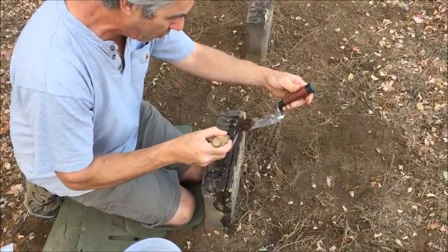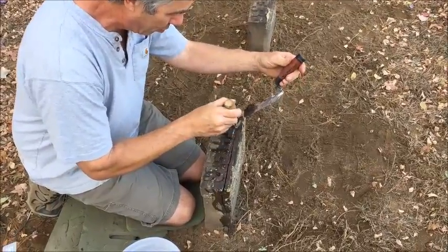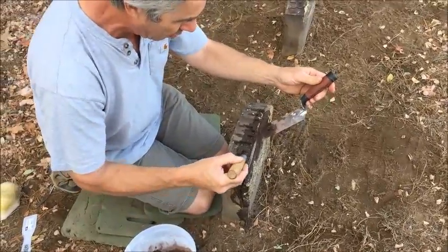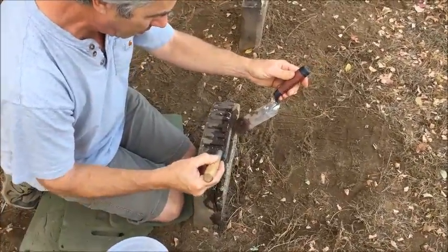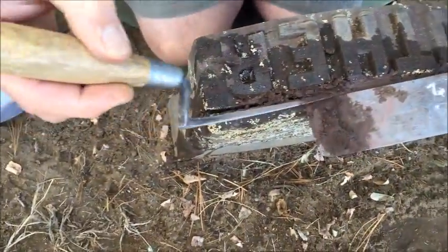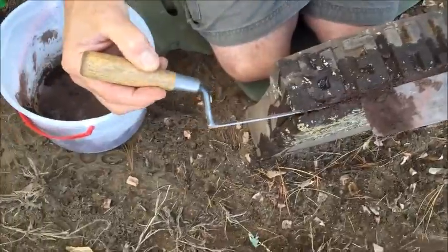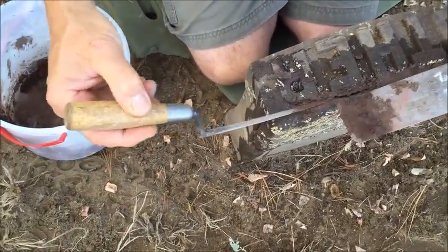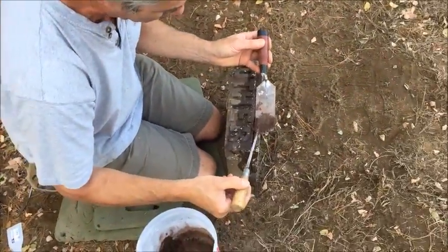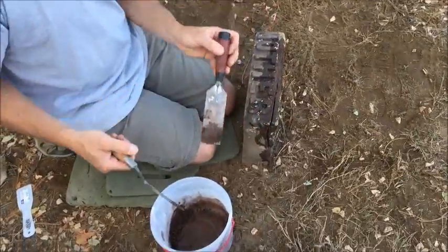This is actually just an extra bonus thing I'm doing that was not even part of this job — I just figured I had to do it because it needed some attention. So this is going to greatly help it; it's going to stop the water from rushing right in here every time it rains. I'm using a couple of Marshalltown trowels — a six-by-two margin trowel is holding the mortar that I'm pushing it off of. Then I'm using what started out as a quarter-inch tuck pointer, but I ground it down into what a lot of people call a butter joint knife because it's so narrow and thin. The thinnest trowel sold is three-sixteenths, and this is even a little narrower at the end than that.